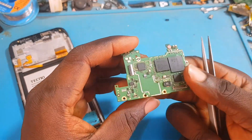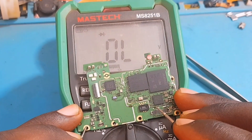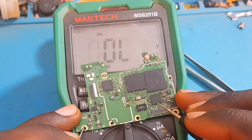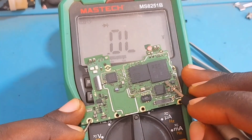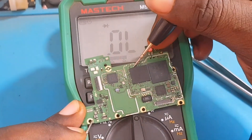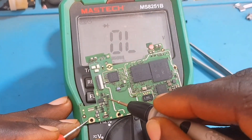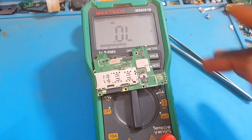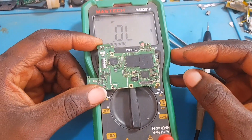From the back side as well, we need to take readings of all the components on the PCB with our multimeter. Put your red probe on ground and use your black probe to take readings. If you don't know how to take readings of these components, I have made a video on my channel on how to use a multimeter — go check it out. I'm going to fast forward and check all the components. I'm touching both sides of each component to check for shorts, checking for shorted components on the VBAT line as well.